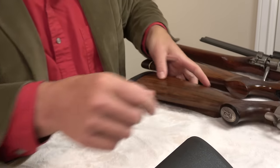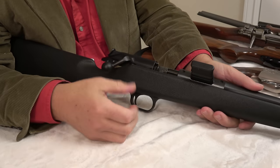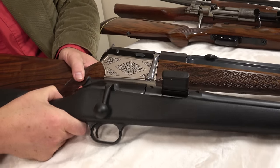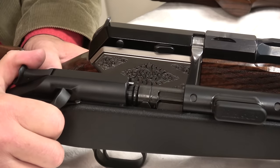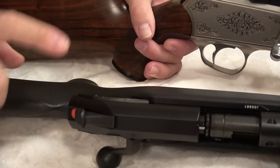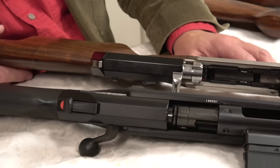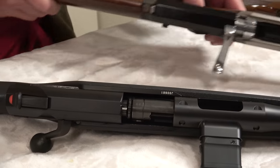We have the advantage of knowing what happened next: they were unhappy with this turn bolt and the location of the bolt handle. So after some years, the next thing that came along was the Blaser R93. You can see some heritage — they stuck with the concept of a short action and rails. But the engineering department decided that for a truly revolutionary design, they had to get away from turn-bolt locking, and so they came up with the expanding collet.